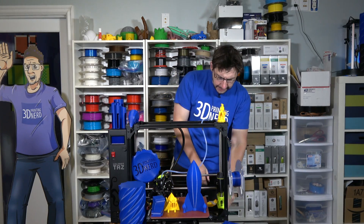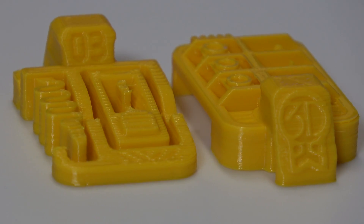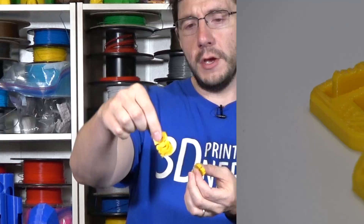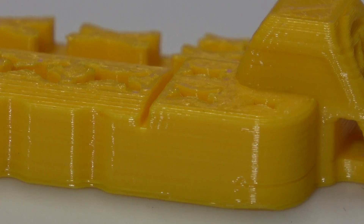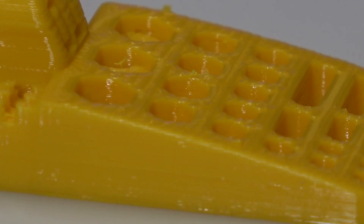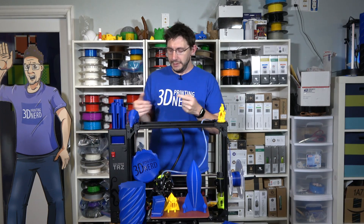There was no Z banding in the cape. I also started printing a lot of 3D kitbash models, which you use to test the features of your printer. I did have a failure on a couple — one that was supposed to move had a fused claw that broke off, and another didn't hold together well. But the rest turned out great. Most importantly, I was looking for Z artifacting and banding, which I was getting in the previous version, and none of the kitbash models showed that. They all look great — using the same material and even the exact same spool.